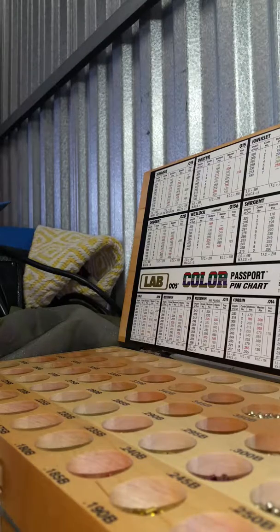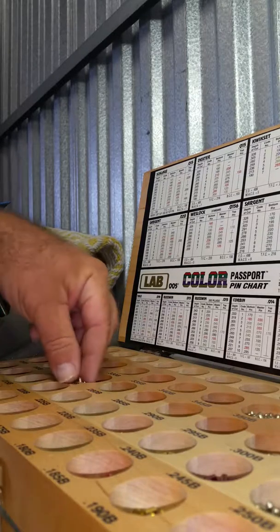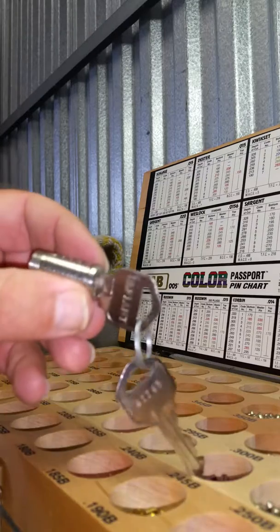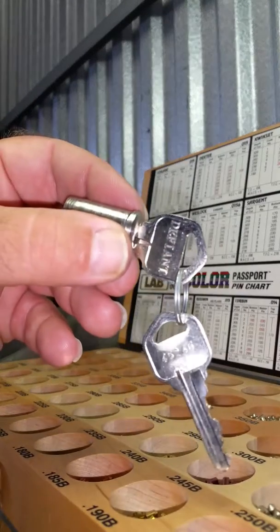As a matter of fact, that last one — we're going to go up one more, up another five-thousandths, just to give it a little bit of extra clearance on there. And there's your secured pin. We'll come right back and put this thing back together.